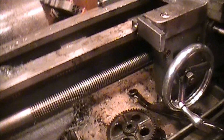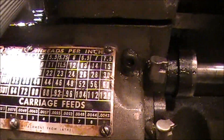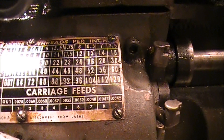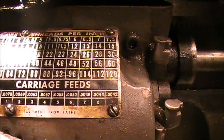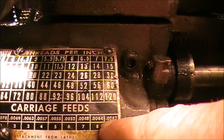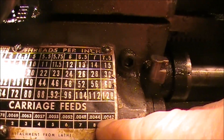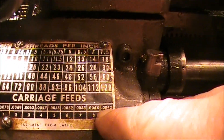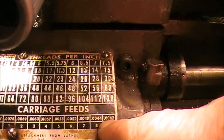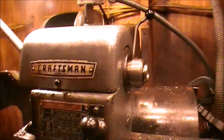So I ended up buying one gear too many, but I was going by the instructions I was reading online and they were kind of vague. You can see the slowest feed rate right there: 0.0042 per revolution — and we've cut that in half. Now we're at 0.0021 per revolution, considerably slower. That should give us better finishing cuts and that type of thing.